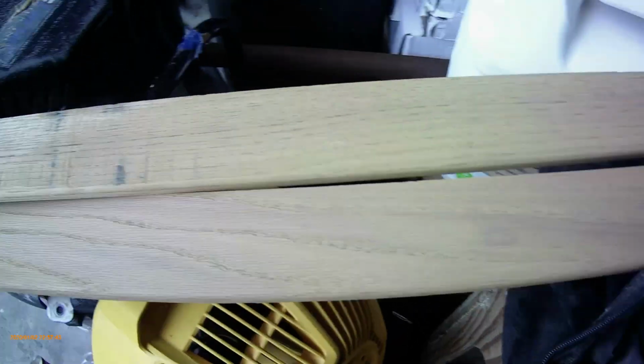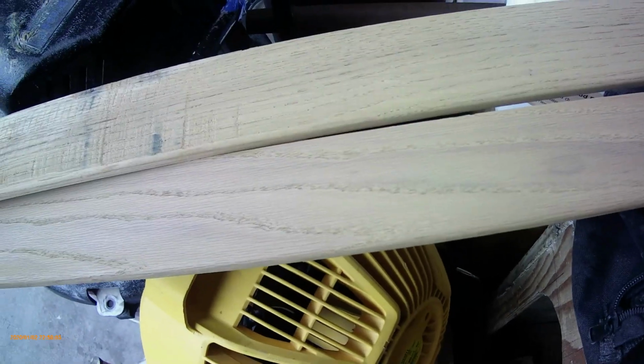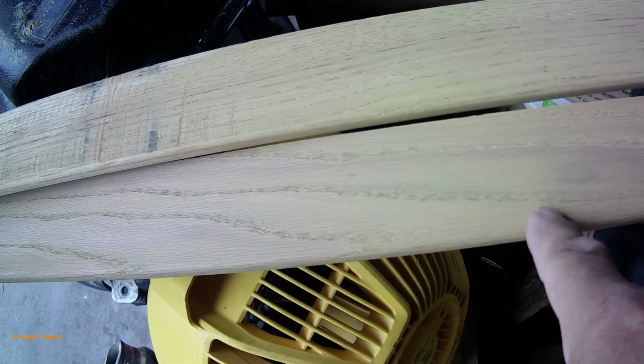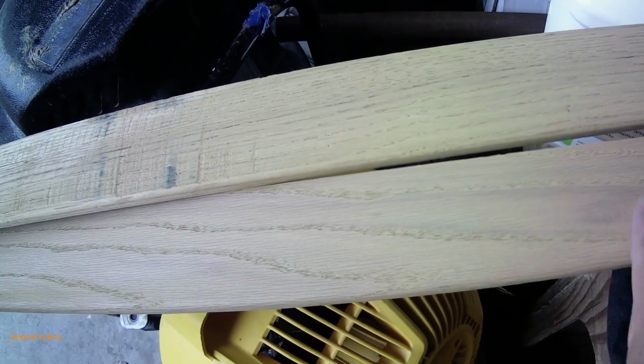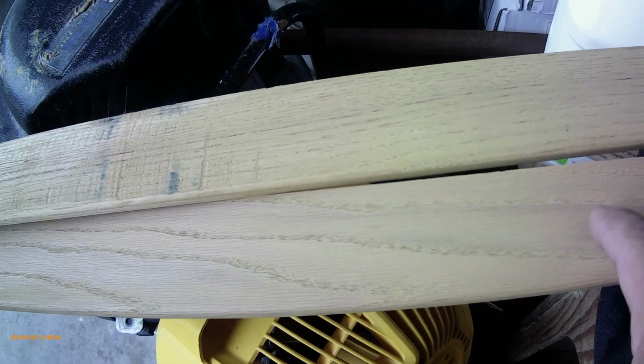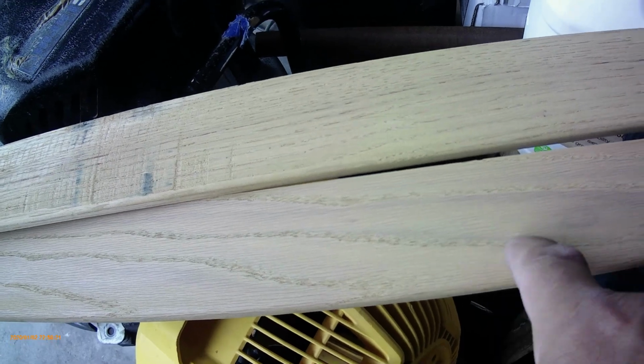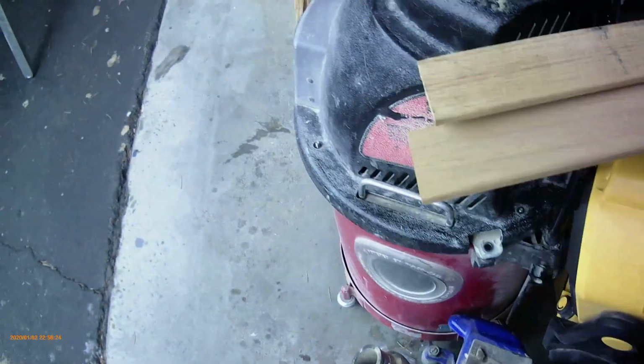And if you're a floor guy, you know that some of those grays really don't stain the wood gray at all. There's not enough pigments in them, and if you don't prep the wood correctly, you can't get any of that color to penetrate. So typically on the wood here, in between your spring wood or soft grain, it typically doesn't stain gray at all. And so this ages over time, and actually the color of the red oak will push through naturally, and the gray stays in the grain, and you get this two-tone effect.